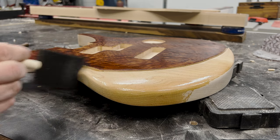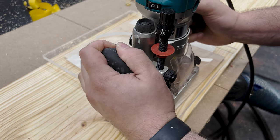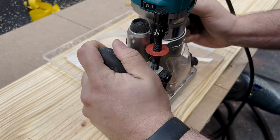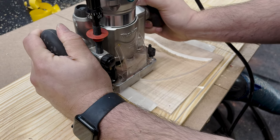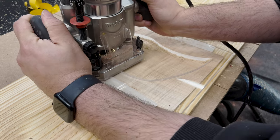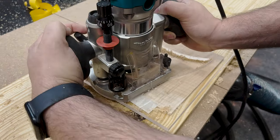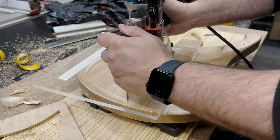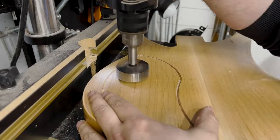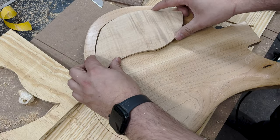To cover the electronics, a bit of flamed maple Andrew had from our guitar build, link in the description, was used to make a unique backing plate. He made an inlay template on a CNC that followed the contours of the lower part of the body and proceeded to make the inlay and route out the pocket for all the electronics. I'm not saying this for any particular reason, but make sure you have all your pickup hardware on hand before you resaw your body. Just saying.